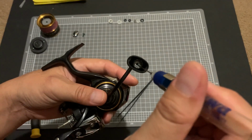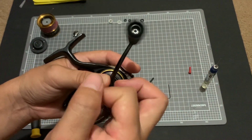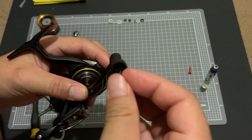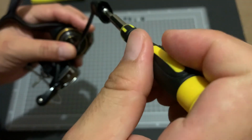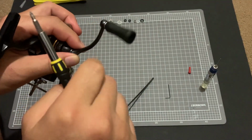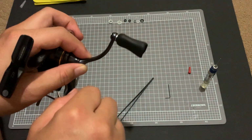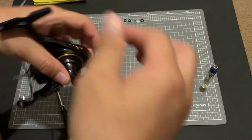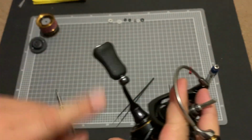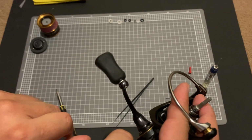Apply oil to ensure proper lubrication. Then, tighten the screws. If clearance adjustment is needed, add a 0.1 mm shim and adjust accordingly. This upgrade is very simple but noticeable in its effects. If you're interested, definitely give it a try.